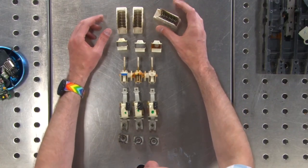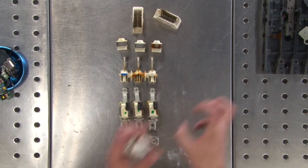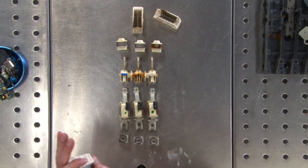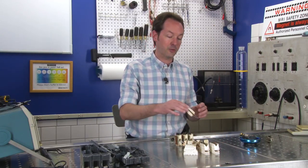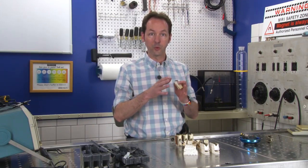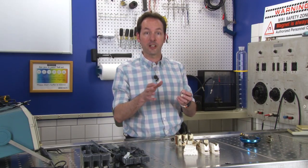So what this does is all this stuff at the top, these finned enclosures are designed to suck that arc up in and quench it, because you want to draw the arc out, and you want to get the arc broken into pieces and dispersed as quickly as you possibly can. And that's exactly what these are for. And there's some really cool stuff involving magnetics that does this, because remember, the arc plasma is an electrical circuit. It follows rules. It's the exact same thing as how a CRT works. So you can look into that and see how an electron gun works in a CRT and how they aim it. And you can do that electrostatically and electromagnetically.